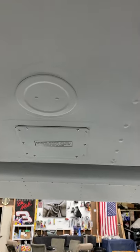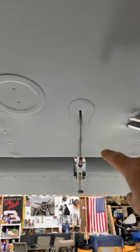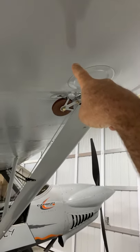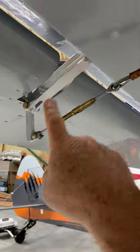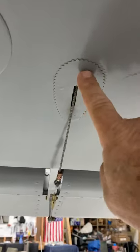You can see that the location is good as shown in the manual. When we come back over more inboard, we can see the little teardrop that's going in there. You can see how I talked about lining it up here. That pulley cable on the upper inside, that we put in the upper pulley bracket on the wing, is going to come back down, cross through, come out the wing here, and mount to the aileron off the mount half of the aileron hanger rod. You can see where that should be — it's lined up exactly as shown in the book.